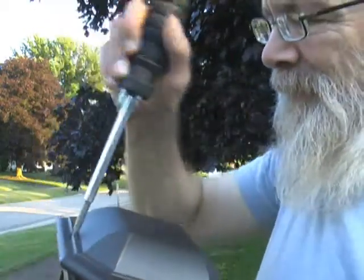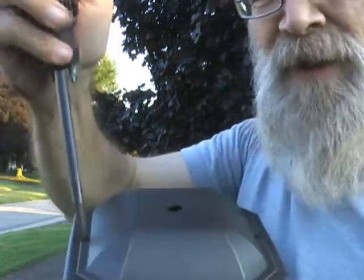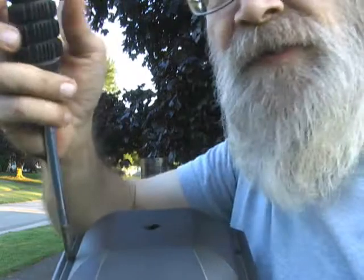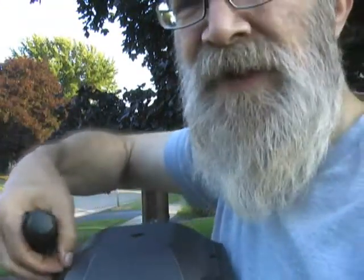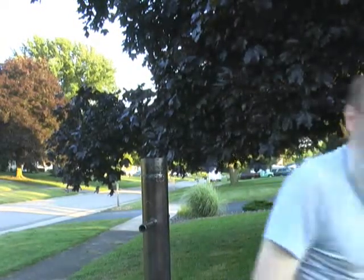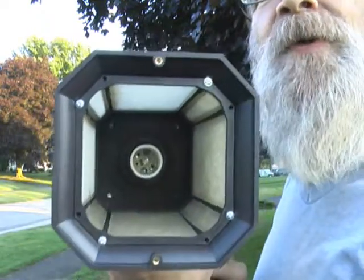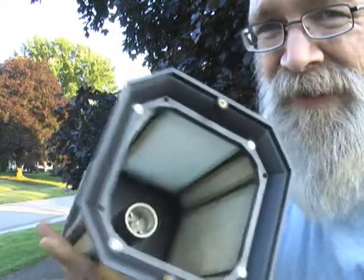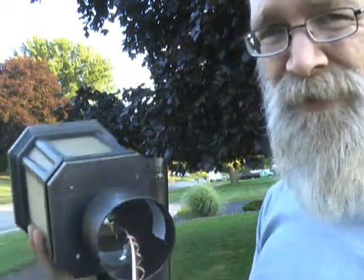All right. Second screw. And you can't see it on the camera, but I'm actually holding the bottom of the lamp up against my belly, holding it tight to me in place of having a workbench to work on. A lot of times I've done things up on ladders that I've been 20, 30 feet up in the air, and I'm doing this, and there's not a whole lot of workspace. So, okay, now we've got the lamp open, and inside you've got the socket, and you'll also notice that there's four drain holes, which the old lamp didn't have. Again, the drain holes, just like the ground wire, have become standard as people figured out why people got shocked or things failed sooner than they should have, or what have you.